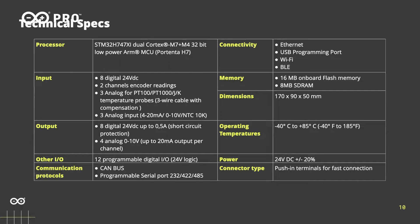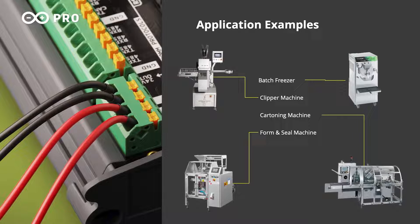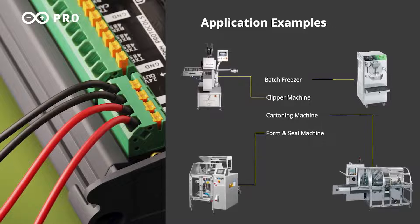Let's talk about technical specifications. The heart of the Portenta Machine Control is the Portenta H7. The board has a lot of inputs and outputs for connecting existing machinery. It has digital readings such as an encoder, and analog inputs for temperature probes PT-100 and PT-1000, analog inputs for 20mA, and a lot of outputs — either digital or analog — that can be used to drive external equipment. Push-in terminals for fast connectors allow easy and fast implementation in your existing product.